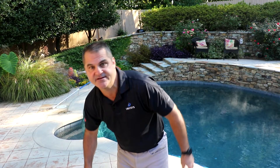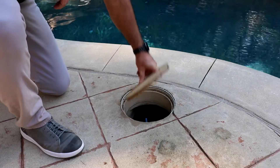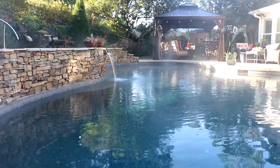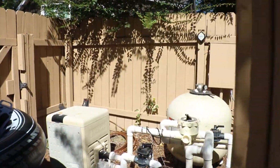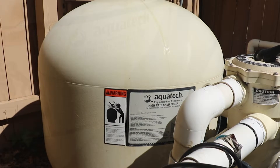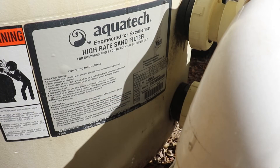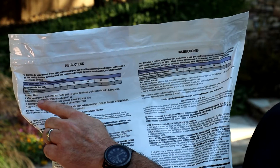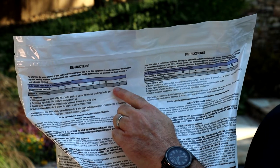Follow me and we'll do the next steps to adding the DE AquaCell filter media pouches to your pool. After you've cleaned the pool and back washed your filter, next you'll need to determine how many pouches you need to use. You can do this by determining the effective filtration area or square feet specs of the filter equipment for the pool you're working on. If you don't know that offhand, you can always check the owner's manual of the pool filtration system, or sometimes you can simply find the information posted on the outside of the filter unit's housing. Once you've determined the square footage of your pool's filtration area, refer to the back of the bag to know how many pouches to add for each square footage. There's absolutely no guesswork.